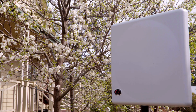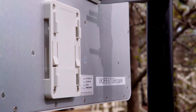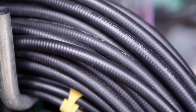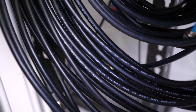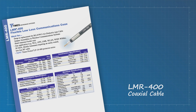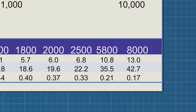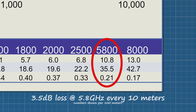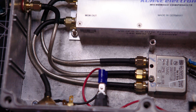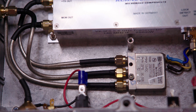A panel is a good place to start. The ability to adjust the antenna in both the horizontal and vertical axis is important. Your choice of coax and length is also critical at this frequency. Keeping in mind that 3dB loss is halving your power, LMR400 — also known as LL400 and C&T400 — loses 3.5 dB every 10 metres at 5.8 GHz. LMR400 is a semi-rigid coax in an RG8 form factor and isn't really that flexible. Your interconnecting cables also need consideration as to coax type and length, and be sure to avoid right-angle coax adapters.